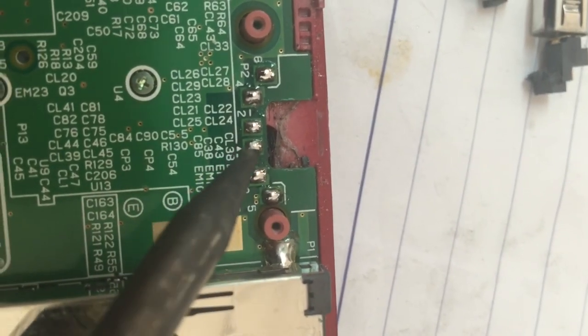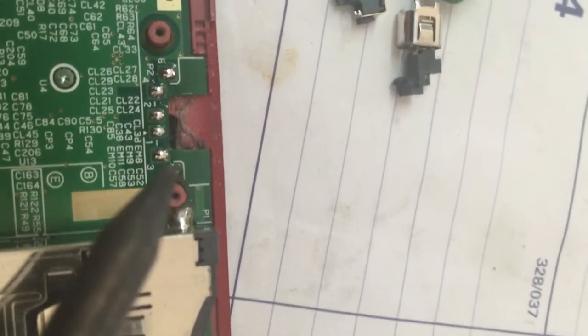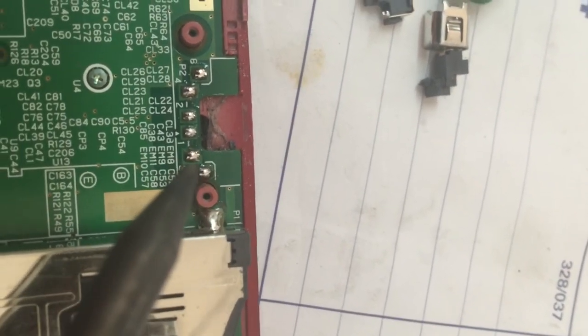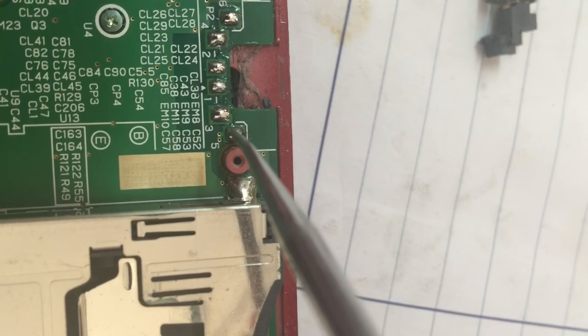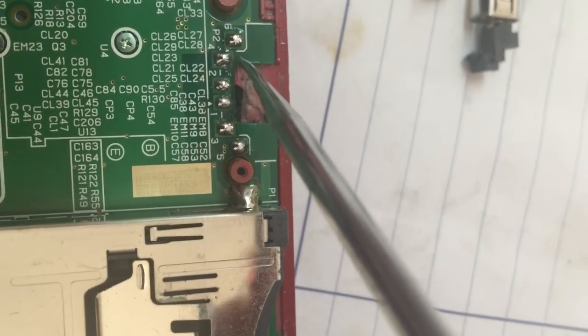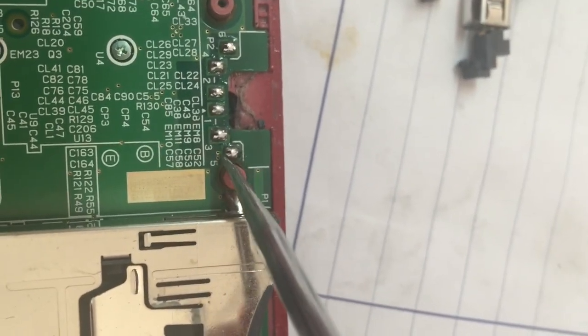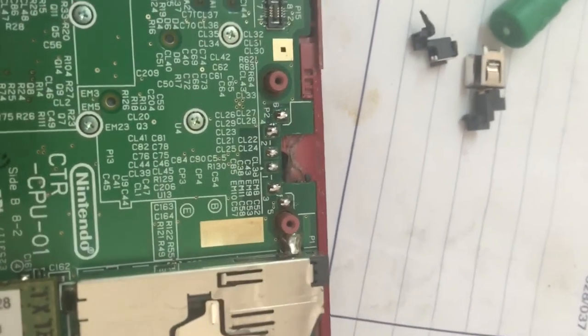You really don't have to do this for too long - as soon as you touch it, it'll melt if the iron is hot enough. Added a little bit more solder, then I'm gonna put the new one in, touch each point gently for a couple of seconds and it'll melt. You also have to be really careful not to put too much solder where one point ends up touching the next one. Make sure there is a space in between each one so they don't touch each other. Alright, already soldered it back on.